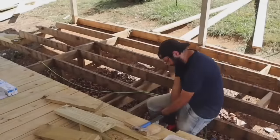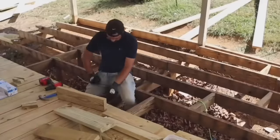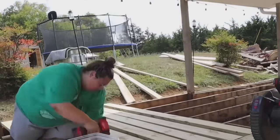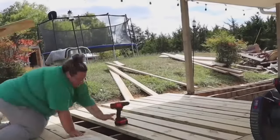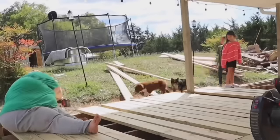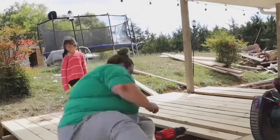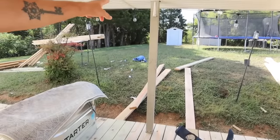Here are the supports Shane's added now that kind of saved our tails. It basically just added another layer in between the seam so that neither of the planks had the opportunity to dip down in the middle and start warping, sort of. So Shane lengthened out the porch where the steps dipped in. He lengthened out the porch because I really wanted porch length steps.